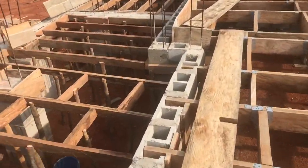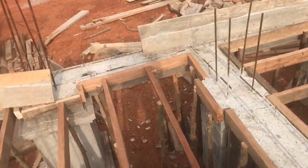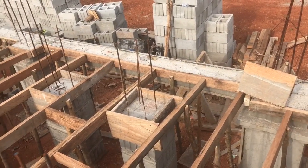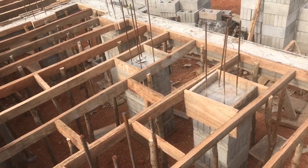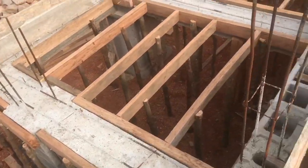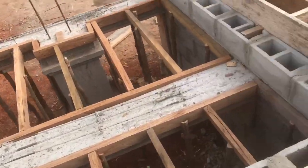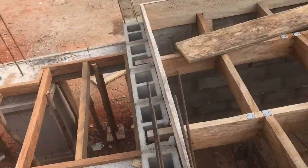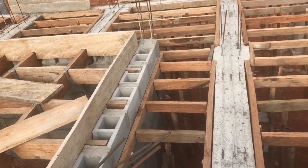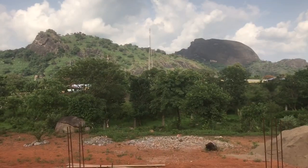That is about everything for today — I just wanted to bring you up to pace with where we are. After we put the plywood down, we'll come back and put the rabbet edge up on the edge, secure it to keep it nice and straight. Then they'll come in here with all the rebar and tie it in on a grid pattern, just like they did in the back. Maybe Monday or Tuesday — about a week after the back is poured — the front will be poured. The guys are doing great; it's hot out here and they've been at it since 6:30 this morning. I'll leave you with the nice view off the front of the house. Talk to you later!